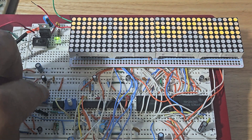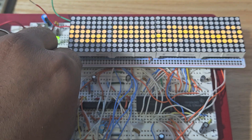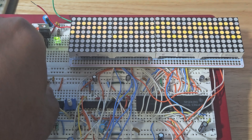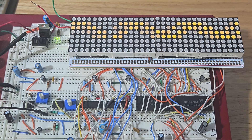As you can see the triangle wave is coming and going, it's drifting. We have the sweep or time control right here, and this right here is the gain. Let's see if we can track this triangle wave. This potentiometer is really sensitive — there it is, triangle. It almost looks like a sine wave; it's not going to be precise, you're not going to get a really sharp triangle wave, but you can see it. I can also adjust it from the generator.